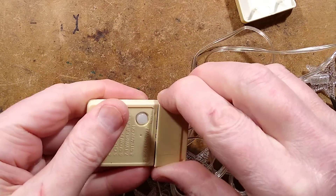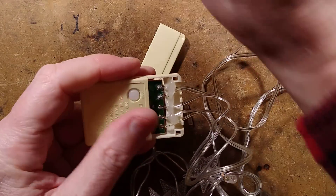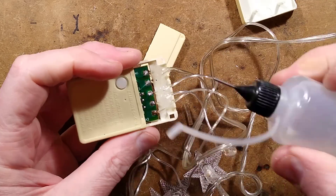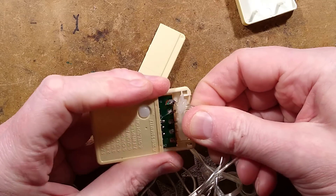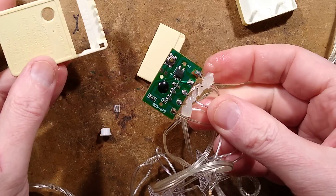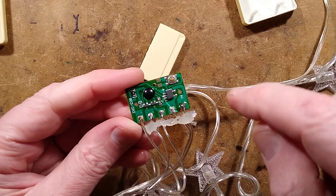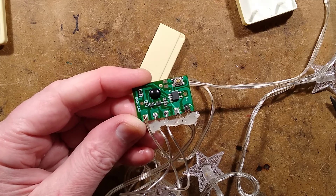What about this little safety plate? It comes off easily as well, revealing hot melt glue. Let's get the circuit board out — a little drizzle of isopropanol onto the hot melt glue should cause it to release fairly quickly. And I've just ripped a track off the PCB. That's all right, it's also to be expected. The PCB is absolutely tiny.